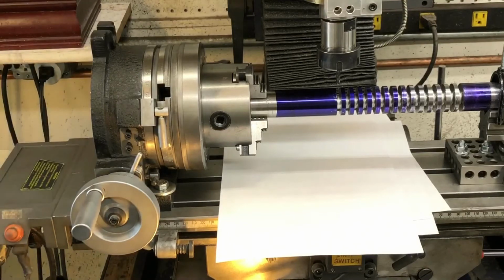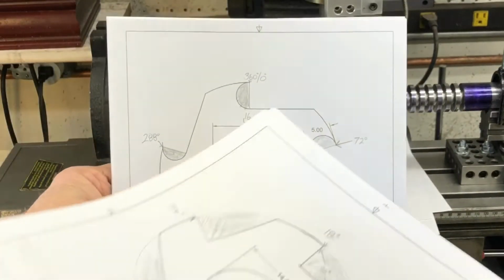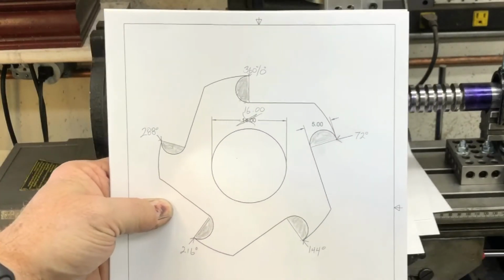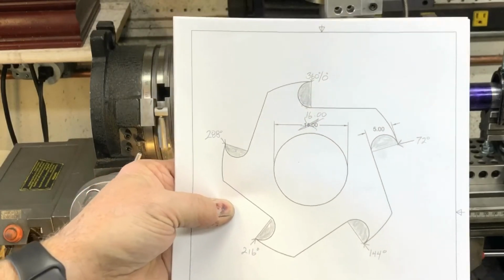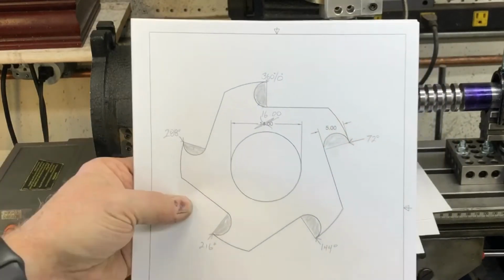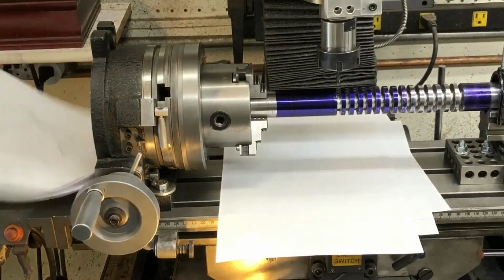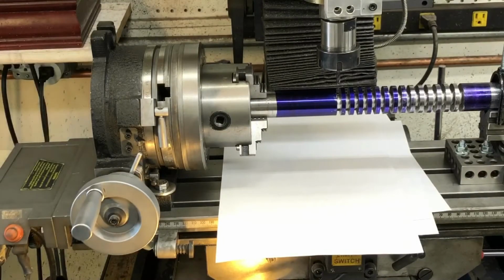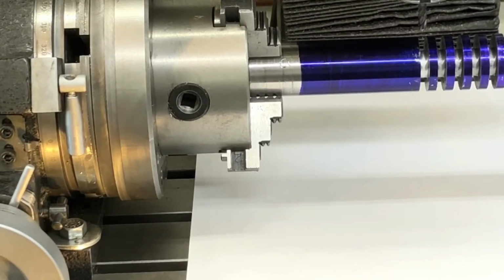At the end, I go back around with a carbide ball end mill, and I put the radius cut across the end of there to make the final teeth. All of this just to make the cutter. Because it's all one piece. This is all going to be one piece of metal.